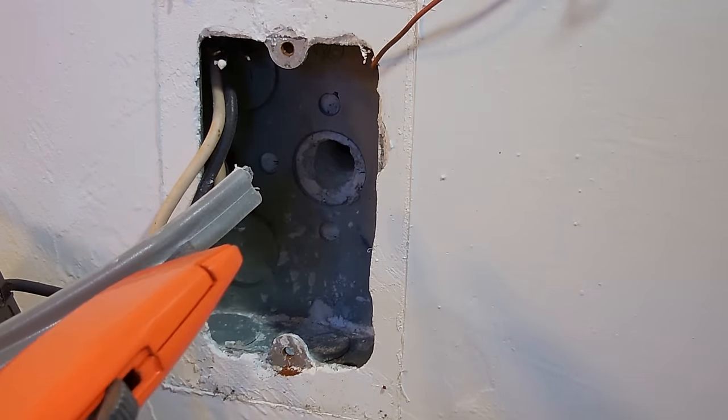Okay, let's go out. Okay, the wire's through the wall. There's a couple of ways that you can put the box on the wall to hold the GFI receptacle. The first way, you would take a metal box and you can trace it right over the center of this wire going through the center knockout in the back of the electrical box. You could take a larger drill bit, drill in about an inch and a half all the way around a series of holes, and then using a chisel, you could chip out the area and tap con the metal box. By doing that, the receptacle will end up flush with the wall when the waterproof cover's in place.